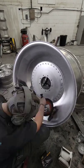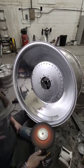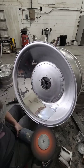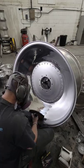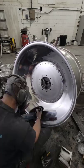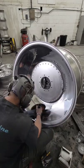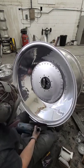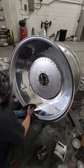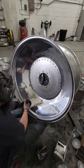We're cutting it with a 6,000 RPM grinder, using a 9-inch orange airway buff from GoShineOn.com, and using the brown compound from them as well. This is my favorite setup for cutting aluminum — it works extremely well and cuts through the sanding marks. This wheel was huge, so it took several passes to get the finish I wanted.